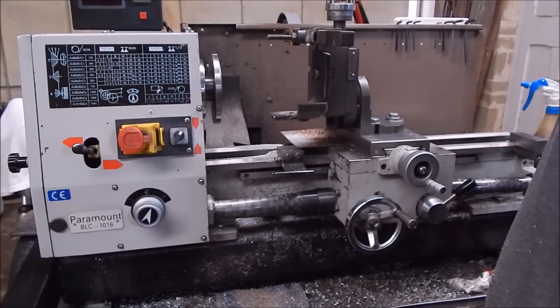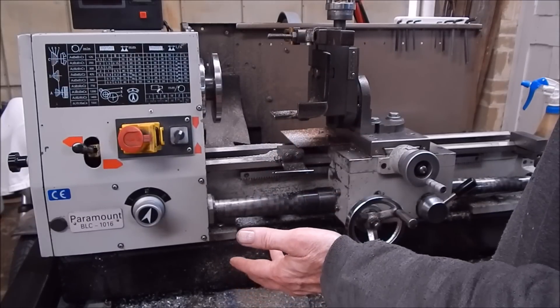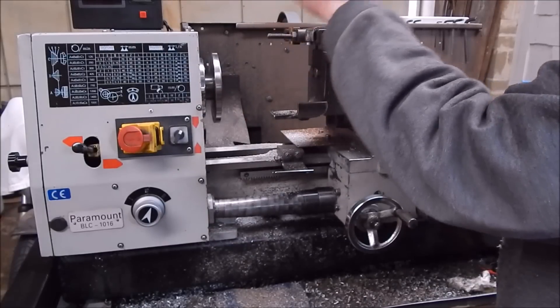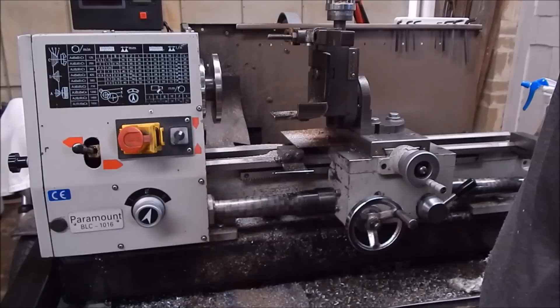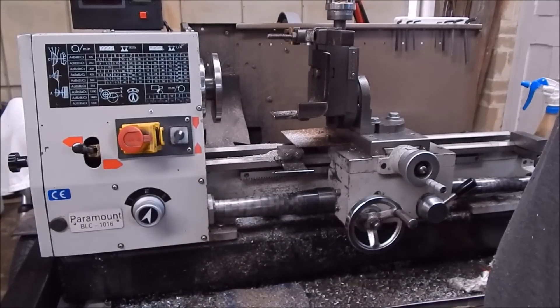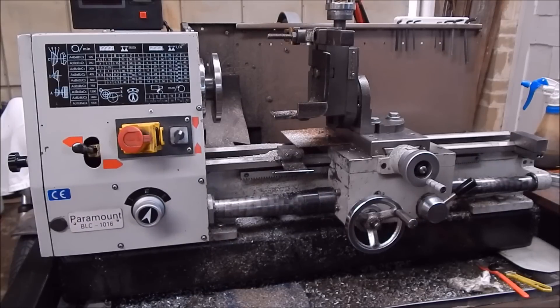It just shows you that you don't need fancy equipment to do a lot of this work — common sense, take your time, be accurate. We did all this with a vertical mill slide, a right angle bracket, a locking clamp, a spindle, and a reference disc made from a pie chart. You could use a fly cutter, but I use an involute cutter because it's faster and cuts quicker. If I can do it, you can do it — anybody can cut gears if they just sit down and have a go. Okay, that's it for me — I'm going to have a bite of lunch and probably a beer. See you next time, cheers.